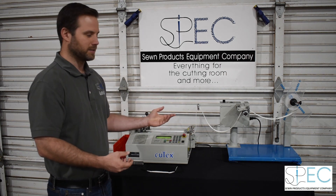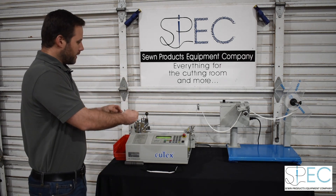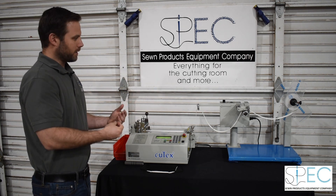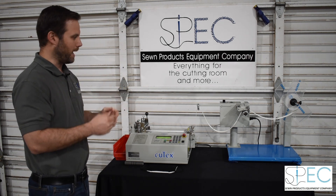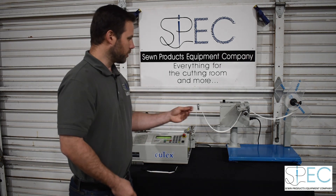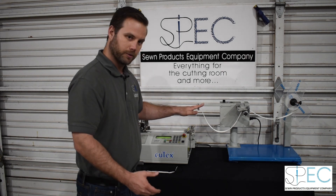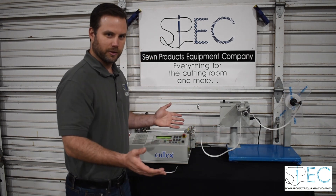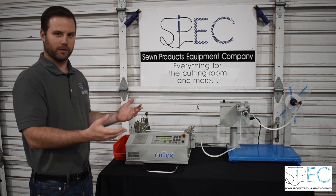The TFD-92S pre-feed machine is especially useful when working with elastic. Elastic is very stretchy, so if you just run it through a machine that pulls the material against the weight of the roll, you'll always cut short — it measures the stretch, then when it cuts, the elastic snaps back. Having a pre-feed like this is great. You want to maintain a loop the entire time to ensure there's no tension on the material, so as soon as it pulls tight, it just feeds the material out.